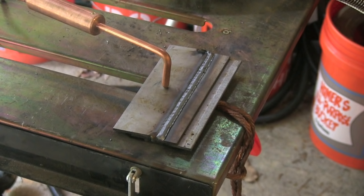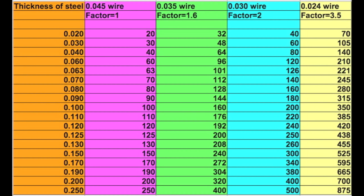This is just one way of setting voltage and wire feed speed. It works for me without a chart — it's repeatable and more accurate than just grabbing a piece of scrap and eyeballing it — but it's definitely not the only way. If you've got a better way I'd love for you to share it; leave a comment and tell us how you do it. If you're welding on a Sunday afternoon, have to deliver the part by Monday morning, and run out of 030 wire but have a spool of 024 handy, this method helps you get right back to work.